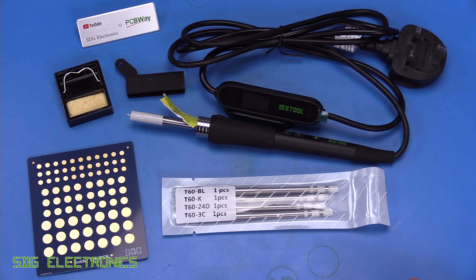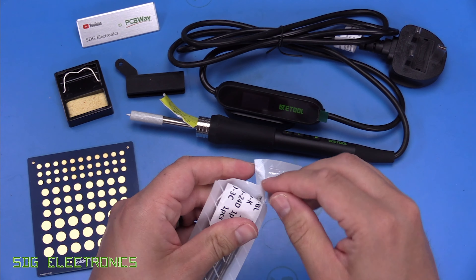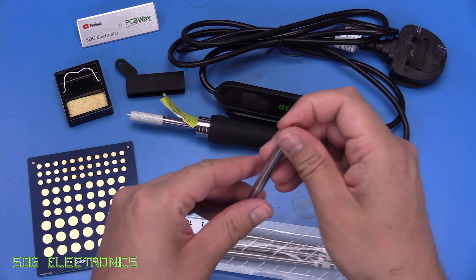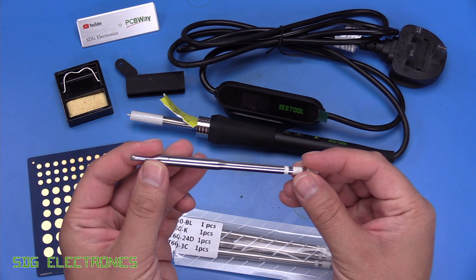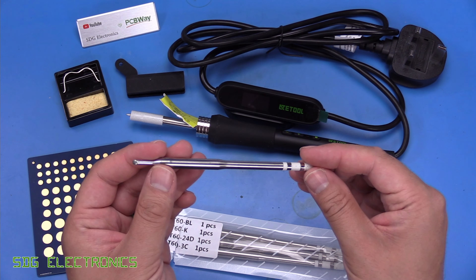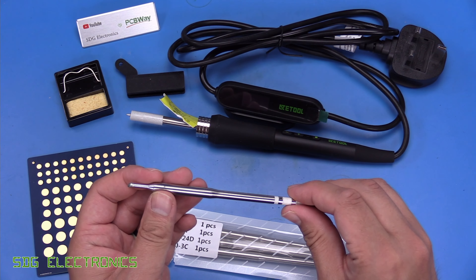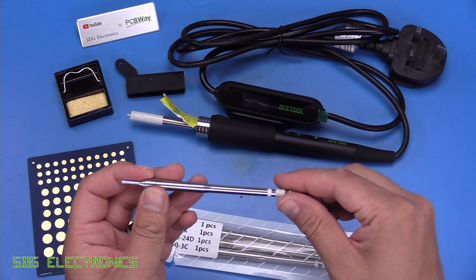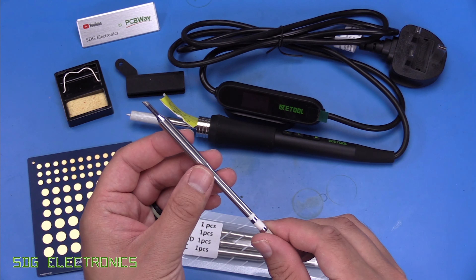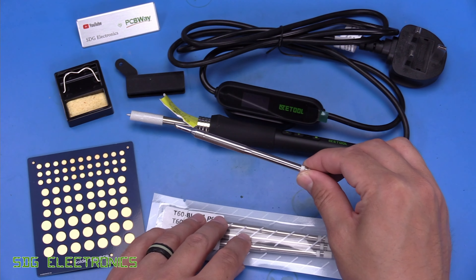This one caught my eye when I was browsing AliExpress because I thought this was a T12 soldering station with high thermal capacity cartridges because they had kind of this bulbous end. But it turns out, as the listing says, these cartridges are actually mains powered — so apparently there's no voltage conversion or anything like that. It does have temperature control so the control loop is done on mains, but these cartridges accept the mains potential directly, which is quite unique these days.